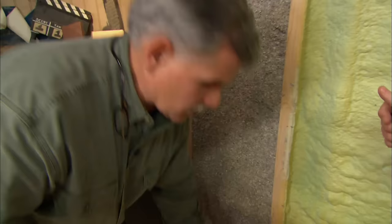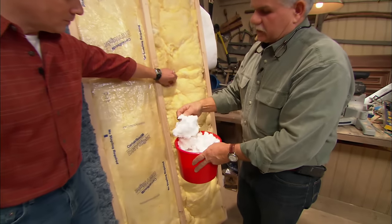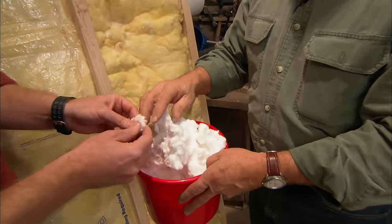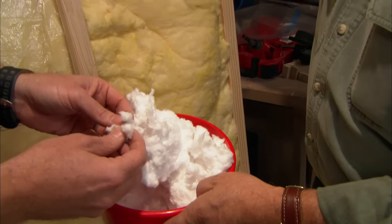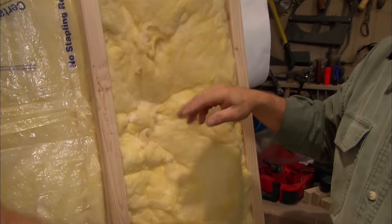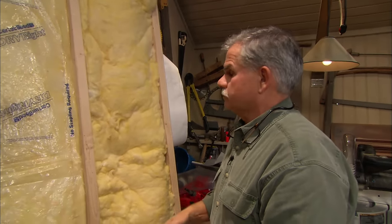Okay. Now the fiberglass insulation over here, you can actually have a product that instead of being in bats, comes in individual pieces like this, and it goes through the same kind of machine, sucks it in through a bigger hole, like a 2 or 3 inch hole, yeah, and dense packs that into the wall cavity also. Again, a double blow is important, halfway up and about a foot down from the top. So also good for a retrofit.